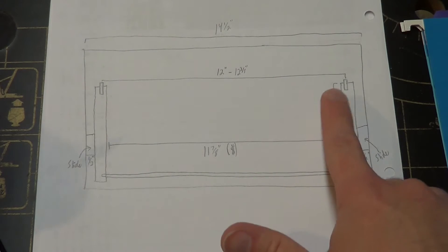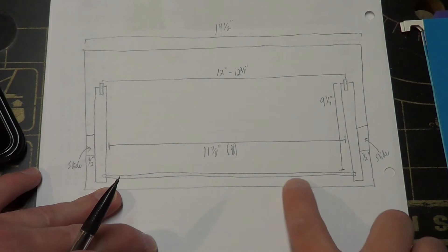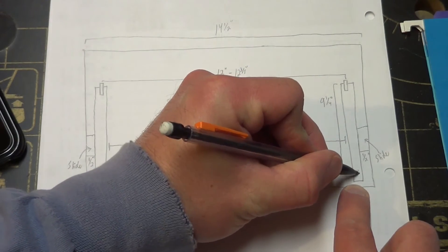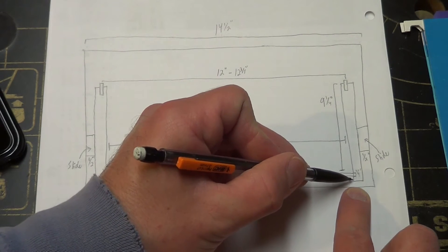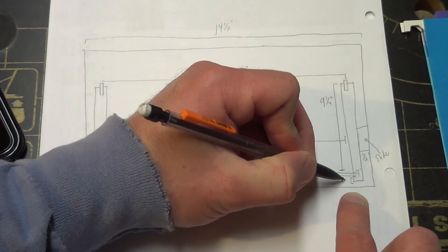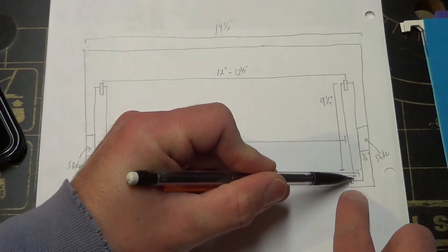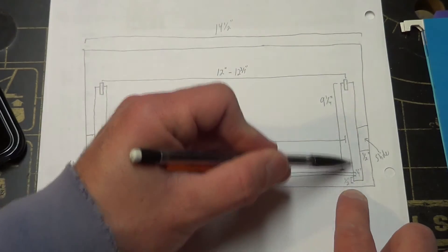So there's that nine and a quarter measurement from the top of the wood all the way down to the top of the bottom piece for that drawer. I'm going to add that total width up — that piece is going to be about a quarter inch or so. And then in order to have some support down at the bottom with this bottom little chunk of wood so it doesn't break off, I can do about three eighths of an inch or a half inch — for right now I'm going to make that about a half inch. So if we take that total: nine and a quarter plus another quarter is nine and a half, and then that last half inch of extra board at the bottom should be 10 inches tall. So if I get a 10 inch board right there, I should be pretty good.